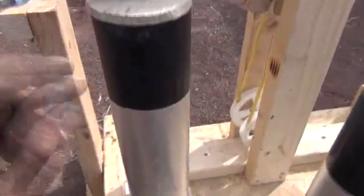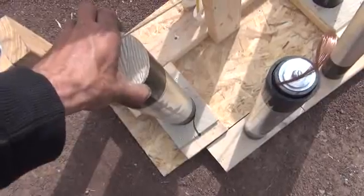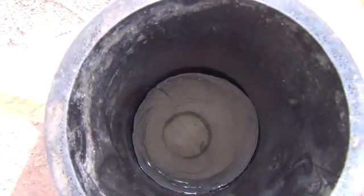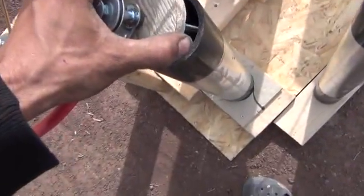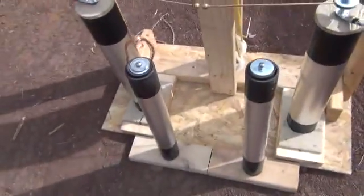These larger ones are a bit more difficult — they require a lot of time trying to get the interior aluminum foil stuck inside a single pipe without an interior tube like the double-tube design. These use a cork made out of wood with a bolt going all the way through to the interior. If you look down inside, you can see the aluminum on the inside, and it looks rough — that's why I came up with the double-tube design. These have brushes off the bottom of the bolt that connect with the inside plate of the aluminum foil in the larger capacitor bank. Set your discharge balls to the same distance and you're good to go.